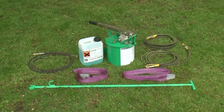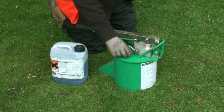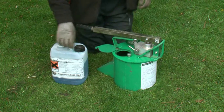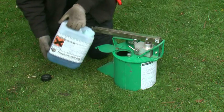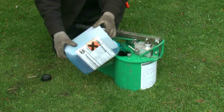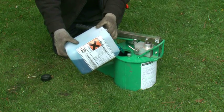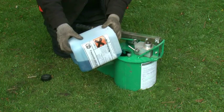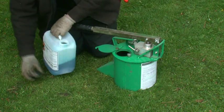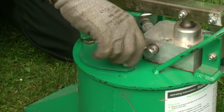The hydraulic medium used in the hand pump consists of a mixture of biodegradable shoring fluid and water. Shoring fluid acts as a lubricant for the system and also prevents freezing during winter conditions. It is important therefore only to use the shoring fluid supplied by Ground Force. The pump is primed by adding shoring fluid to the reservoir tank and topping up with clean water. A mixed ratio of 3 to 1 is recommended for normal working conditions. Details of mix ratios are shown on the label affixed to the pump body.